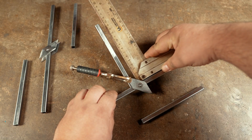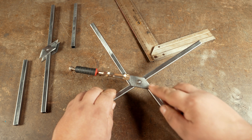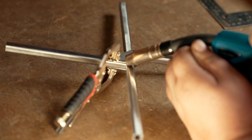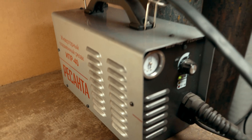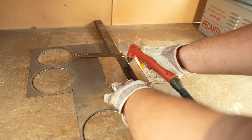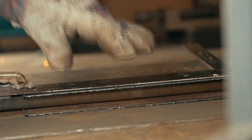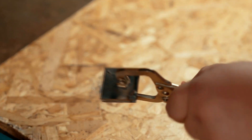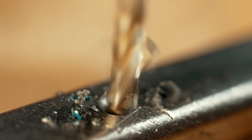I also weld short pieces from each side to this joint. In this construction you can also fasten everything with bolts. Next I need some more identical pieces for the other joints. I quickly cut everything off with the plasma, and to get a more accurate and identical hole location in all the pieces at once, I just weld them together to drill everything in one go. I really like working with this machine, it gives me a buzz. Now all you have to do is cut off a piece — you get 8 identical pieces.